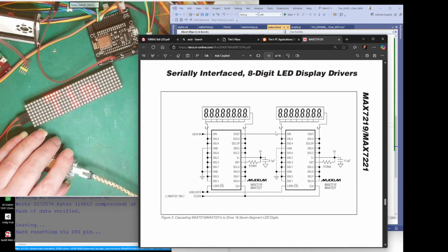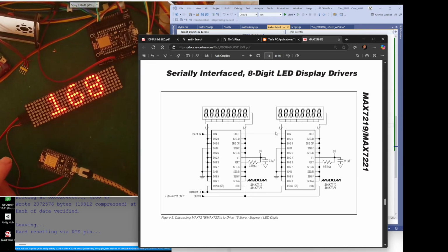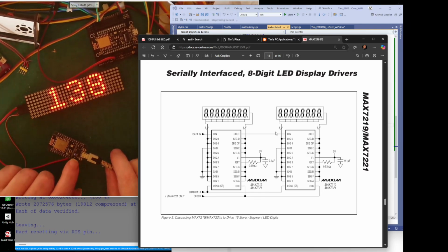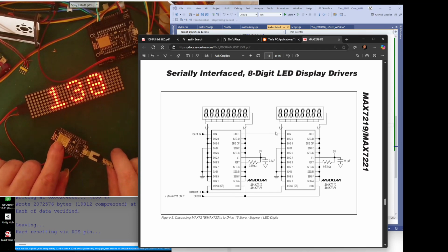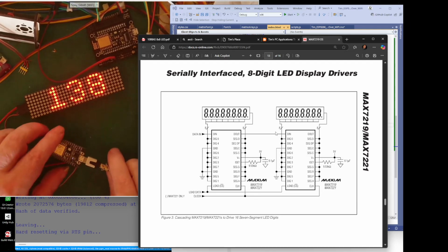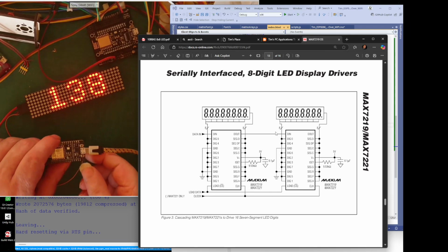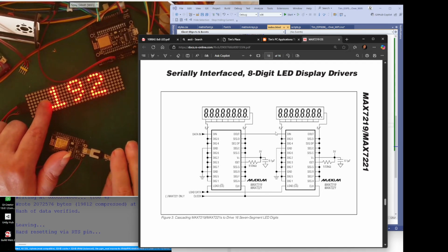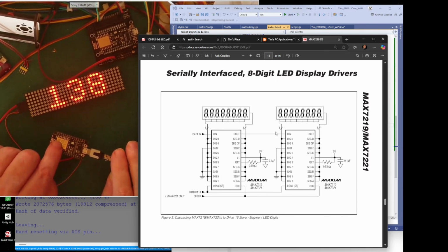now then, let me turn this light off, so hopefully we can see what's going on there. There we go. So once I plugged that in, it came up with 4 numbers. So what happens is we put power, and the server on this ESP module connects to my local network, and our local network assigns it an IP address. So if I just press reset again, it will come up with the 4 IP address numbers. So 192.168.0 and 138.